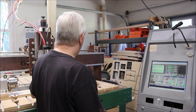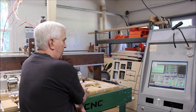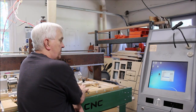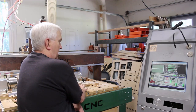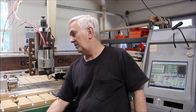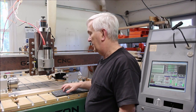Now that I've got the rotary axis connected and the wire swapped out, I need to close out the Mach 3 Gatton CNC machine profile, reopen Mach 3, and select my rotary axis machine profile — and now it should be ready to go. I'll turn my drivers back on and test it to make sure the connection is running. We do have movement, so it looks like we are ready to run.